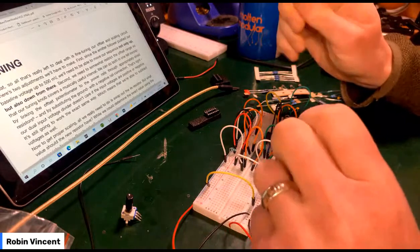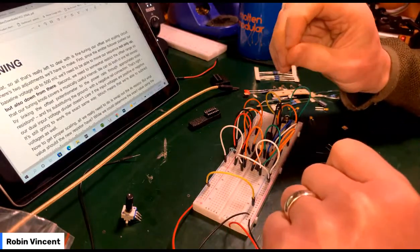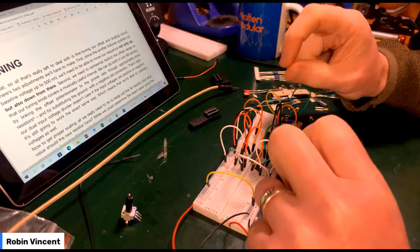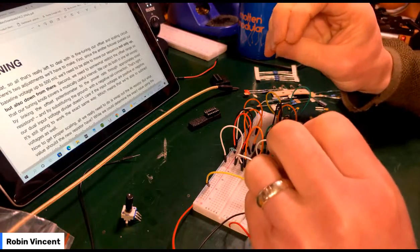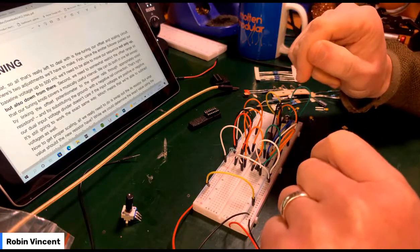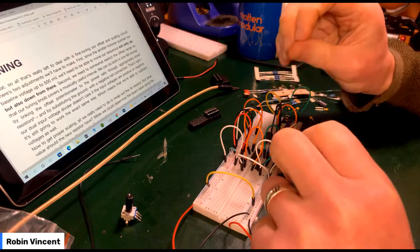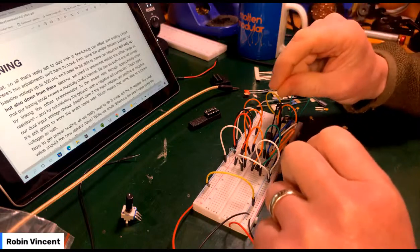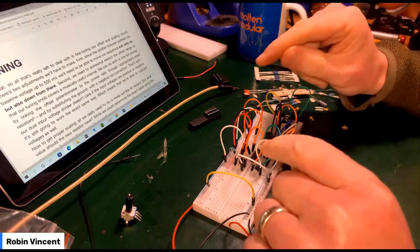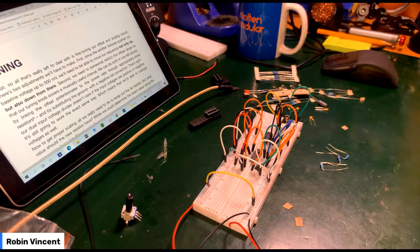Since the emitter follower pushed our baseline voltage up to 500 millivolts, we'll need to be able to move our sequence not only up, but also down from there. Second, we need to somewhat restrict the offset range so that our tuning knob covers a musically useful interval. Yeah, good. We can do both in one fell swoop by linking the offset potentiometer to the power rails through an appropriately sized resistor or resistors. Of course, that's what we always do.